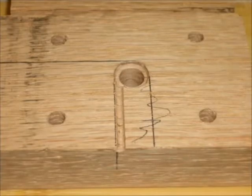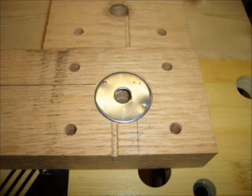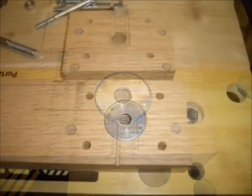There you can see the 1/8-inch diameter hole. I then countersunk and installed a steel fender washer in the back part of the jig. The purpose of this washer is to force the wire to come out the front of the jig as it coils around the steel rod.